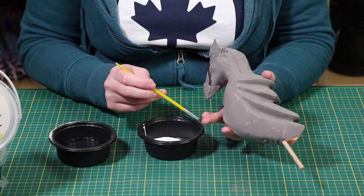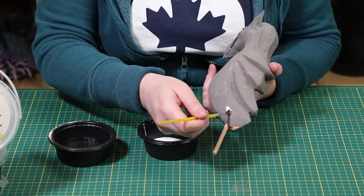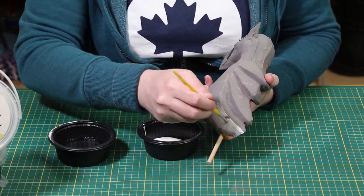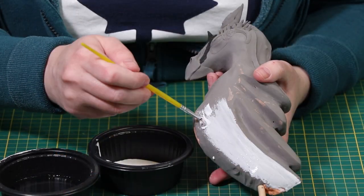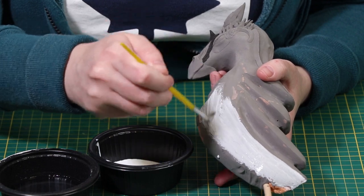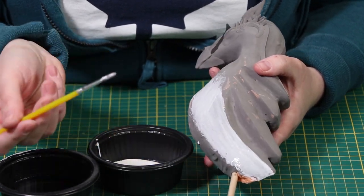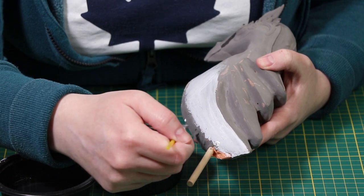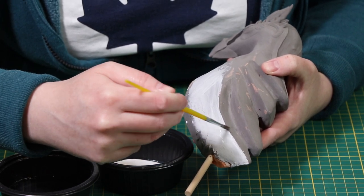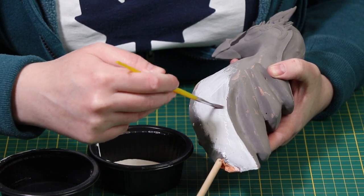When applying Flexbond, make sure to use a soft bristle brush. If you use a brush with stiff bristles, it will leave more brush marks. Flexbond is very thick, which means that as you brush it on, it might leave more brush marks than you intend. If that's the case, you can thin it out with a little bit of water, or apply it in a small area, then take your brush, dip it in water, and gently in a crosswise direction glide it over the freshly painted Flexbond. This thins the top coat so that it self-levels.